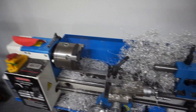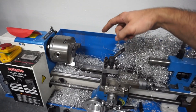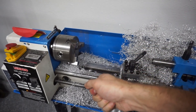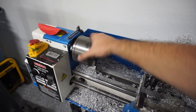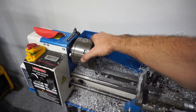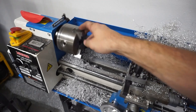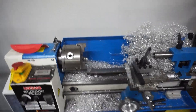It's not the most precise thing in the world and it does chatter a little bit sometimes. One other method of doing the velocity stack is like what Kelvin did on the Nivlak 57 YouTube channel — basically holding a rod down here and using a screwdriver or something to bend it out. I tried doing that and it didn't bend the aluminum at all. This thing isn't very strong; while it's spinning I could probably stop it by hand. Sometimes even cutting material I'll slow it down a lot. So for a job that needs a lot of force, it's not very good. That method didn't really work for this, so the press method was the solution.